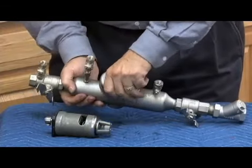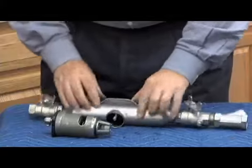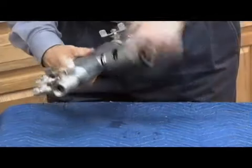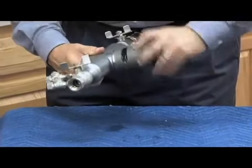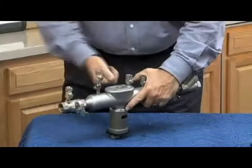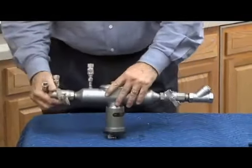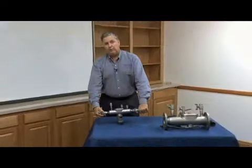Reassembly is going to be just getting the cover in place first, which holds the checks. That retainer keeps the two checks in here. Now I can catch my relief valve body from the bottom. Once I get the O-ring seal right here, up here hand tight, like that, now I take my bolt, and a quarter turn on my bolt will allow me to tighten that O-ring and properly load it. And that's how you're going to rebuild on the small sizes, meaning 3/4 through 2.